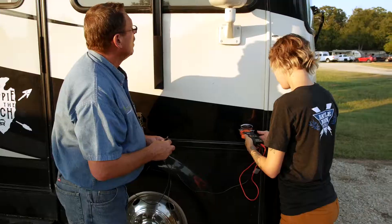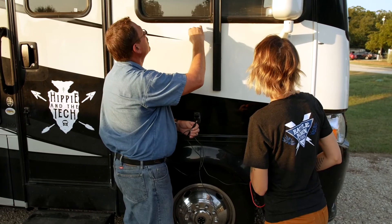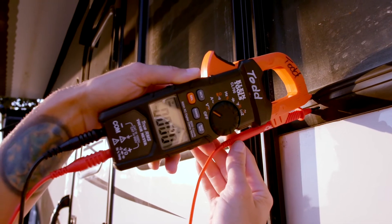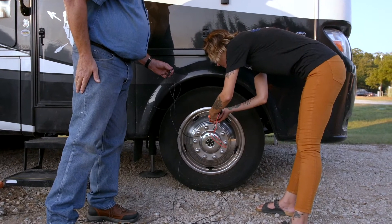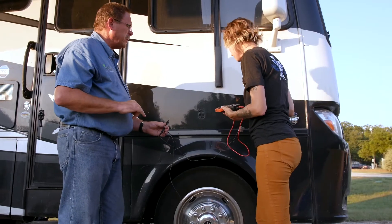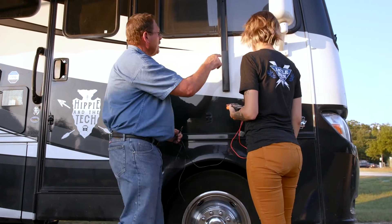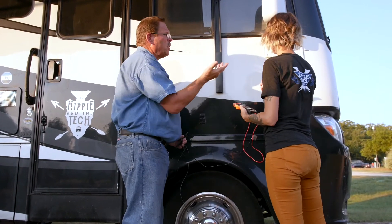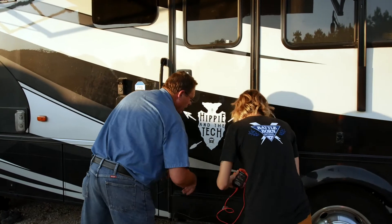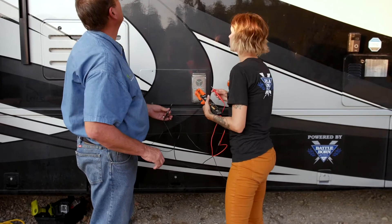On the windows here, these little holes are weep holes so water can drain. You don't want to scrape the coating, but put your probe inside there and get a little good contact. Looking good. Now we have some screws here with the paint chipped off — it'd be okay to touch those; we just don't want to chip any paint. Note that paint acts like an insulator, so even if it was hot you wouldn't know it. Check the hinge — drag across it to get contact. As long as you make contact you'll be okay.